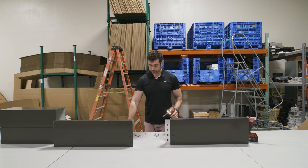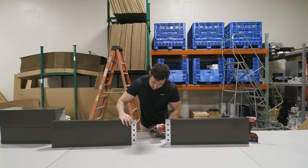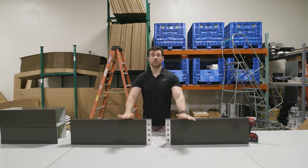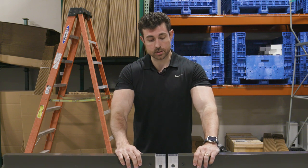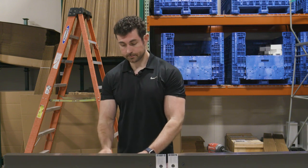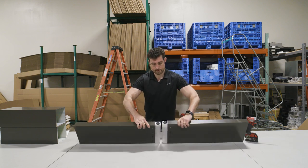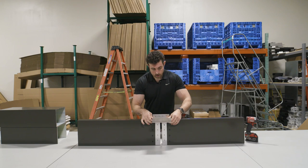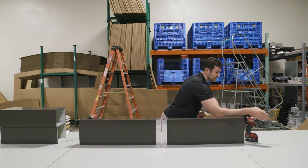Okay, so that's one — let's do the next one. Now our two 12-foot beams are ready. After we connect the two beam-to-beam connectors, these two beams will sit right next to each other on top of that post. So what we're going to do next is take our post connector — obviously we'll do this part on the ground — and line up these four holes here and these four holes in the middle onto our beam-to-beam connectors.